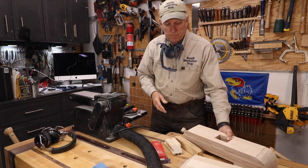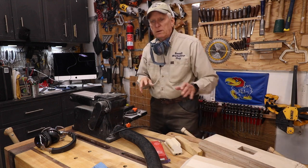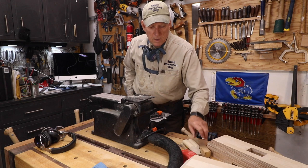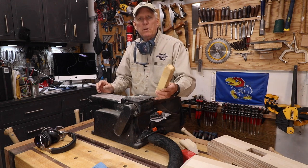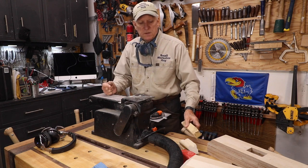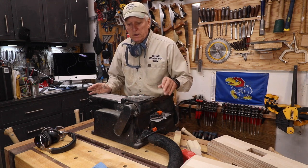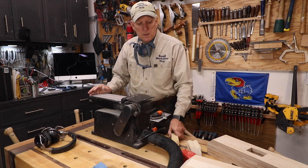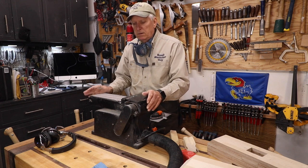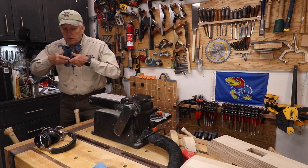All right, so I'm going to do this with the dust collection on, and I'll just do one since I forgot to capture it earlier. Let me move this over in the middle of this camera a little bit better. This is a big old rubber eraser. You want to use that to clean the grit on your sandpaper. And buy yourself some spare belts so that you can put them on from time to time. I see mine's getting a little thin here, but it still works awfully well. And don't burn out your machine by pressing down too hard. Just a light pass underneath your workpiece is all that's needed. So, let's get her going.